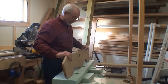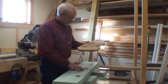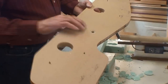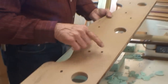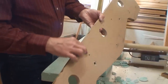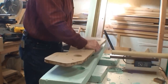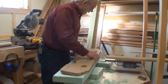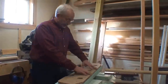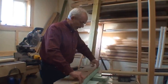When I put this piece of MDF — my MDF form — down on the foam, if you come in a little bit closer you'll see there are some regular drywall screws that are one inch. That means the one-inch drywall screw is going to stick up about a quarter of an inch above or below the MDF pattern. That way when the MDF is in place it's not going to move around.